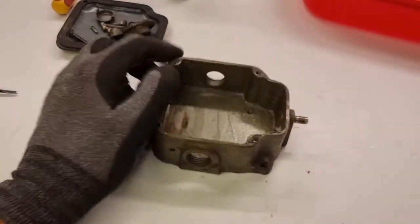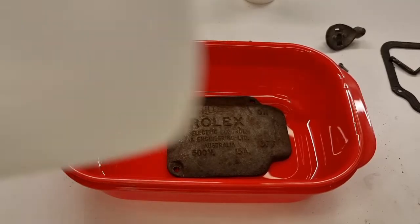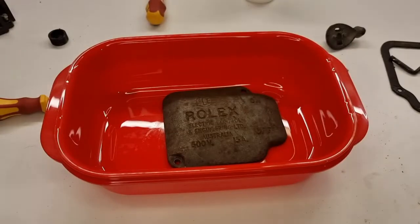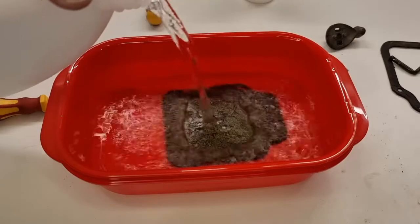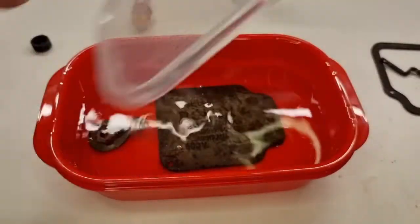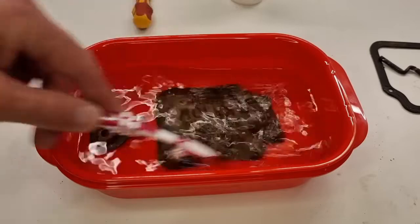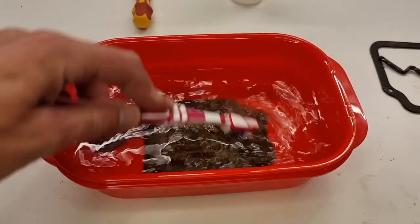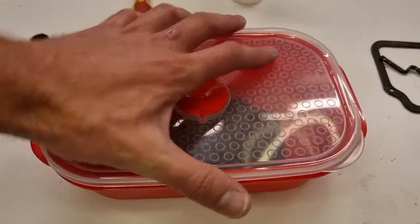For cleaning cast iron pieces like this, I recommend an extra strong vinegar solution — you just let it soak in there for a little bit and scrub it every now and then. I'll pour a healthy amount in there and let it sit, then come back in an hour and give it an attack with the toothbrush. Now it's an hour later — I'm just using a soft bristle toothbrush to loosen up the dirt and rust on the surface, get the vinegar absorbed into that first layer of cast iron. Then we'll seal it back up and do the same thing again in six hours.